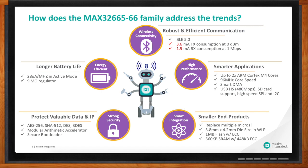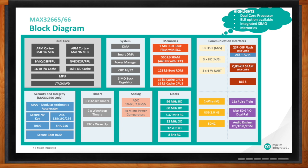Cool. Can we take a look at this under the hood? Absolutely. So here we've got the block diagram for the part. You can see the two Cortex-M4F cores at about 100 MHz, a typical DMA, and a smart DMA — which is like a typical DMA on steroids — that can actually make some decisions and be somewhat programmatic so you don't have to wake up the more power-hungry Cortex cores. There's also access to a big generous internal memory and external memories. If one meg of flash isn't enough, you can pop external memories on there for essentially unlimited memory space. The flash and SRAM also have optional error correction that can detect and correct single-bit errors on the fly, or detect double-bit errors, making for very robust and reliable applications.